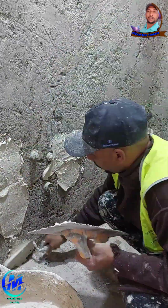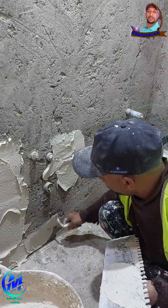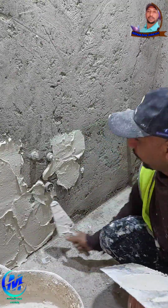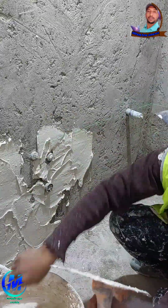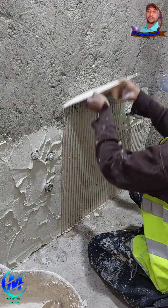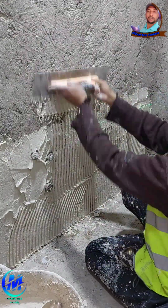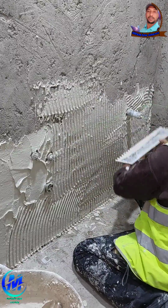1. Planning comes before troweling. Where to place the first tile. Before opening your tile adhesive or plugging in the tile cutter, take a few moments to plan. In small bathrooms, layout is everything. Visual impact. What's the first thing you see when you open the bathroom door? Try to place a full tile in that area, not a cut piece. This enhances the clean, finished look.